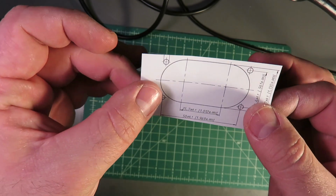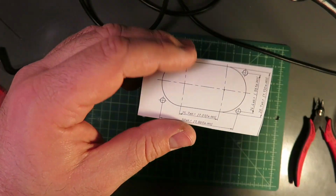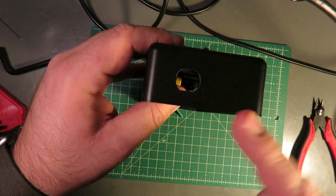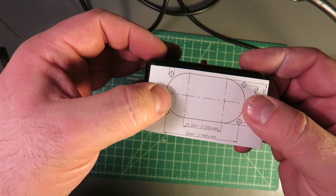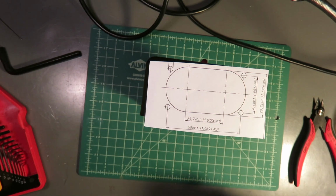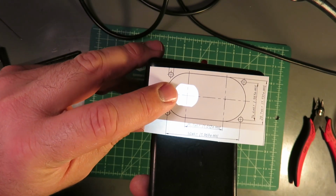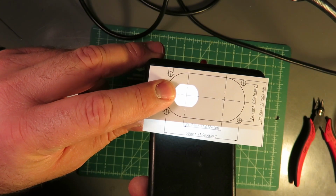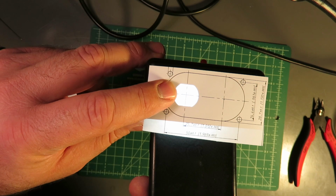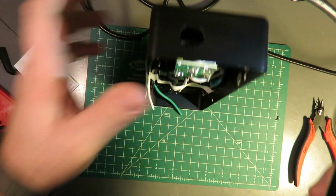So I have cut out the guide for this Neutrik connector. That's available on their website. You have to make sure that it prints out in the correct scale. Some printers will do scaling. The nice thing about this existing hole is that if we take a look and see where, how do I show you that? We can do a little flashlight. So you can see that this hole will actually get you really close to centered. One thing I learned from the first one I did is that cheating it up just a skosh is better, because this bottom strip here will end up pretty thin.